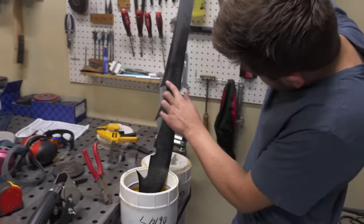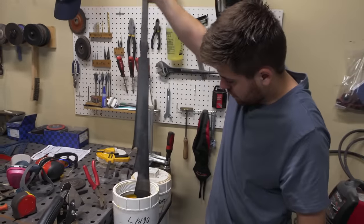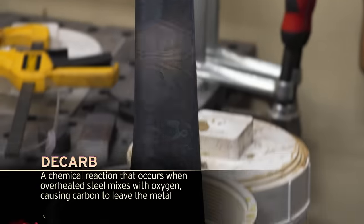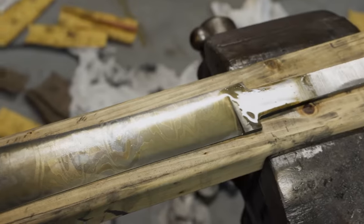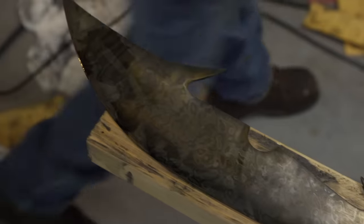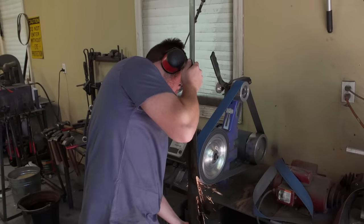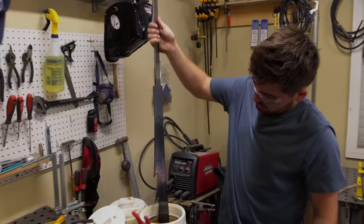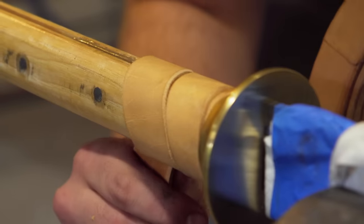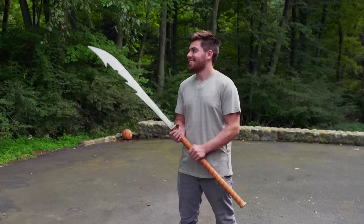Still getting streaks, though. I don't get it. It's just not at all what I wanted to see. There's a bunch of decarb all over the entire blade, which means I didn't grind deep enough, and the edge is not going to come out right. So I could either leave the decarb and the Damascus won't be as good-looking, or I could grind into the blade a little bit and risk making the blade too thin. I knew in order to save the pattern, I really had to just go back to the grinder. And I think it's pretty good — this is the Damascus I wanted to see. I'm still kind of concerned that the blade is a little on the thinner side, but there's nothing I can do now.